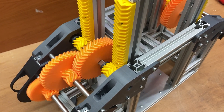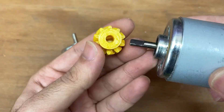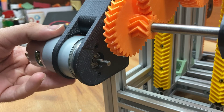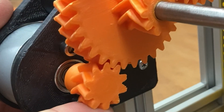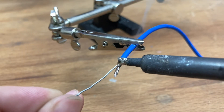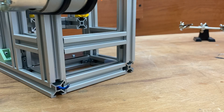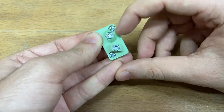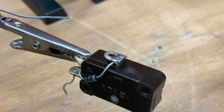As you can see, the gears work smoothly and the head can go down by gravity. These are the 775 DC motors I mentioned at the beginning — they provide the movement, and I placed them onto supports. For the electrics, I connect the motors in series because they must rotate in opposite directions to each other. The press head also needs a limit switch when going up, but there's no need to stop when going down, so I added just one limit switch for the top side.